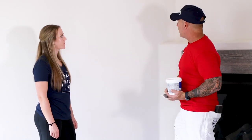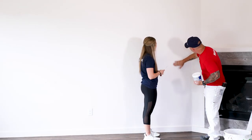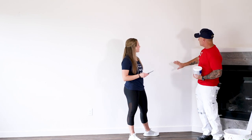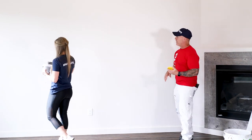This is a flat, smooth wall. If it were textured like an orange peel texture, it's very important to wipe off the spackle around the texture, otherwise you'll have a flat mark there. Go ahead and spackle the next hole — work it in from different angles, press and wipe it on, push the spackle down into the hole. You can wipe off any excess with your hand. Those two holes are perfectly patched. Let them dry, then lightly sand them — they'll be ready for paint. This is the first step to the painting process.